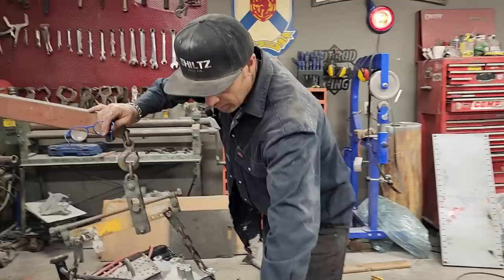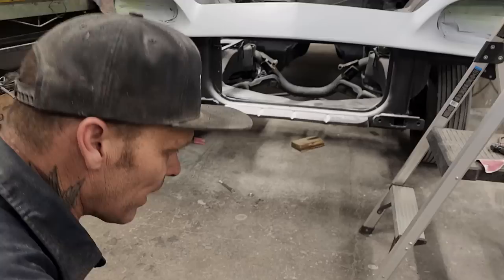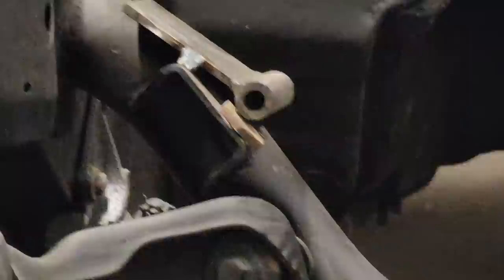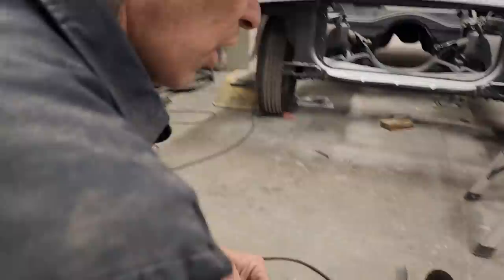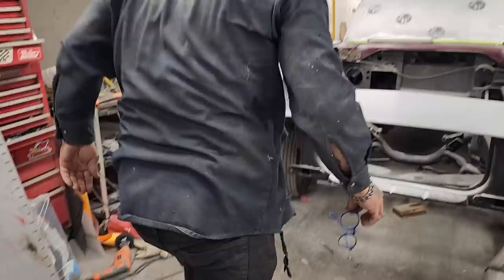But what's going on is, if Jolene wants to come down here and take a lean down and take a look with me, when I tack the motor mounts in, see them little bars there with the pipe on it? That's the motor mounts where the engine sets in. And it looks a little crooked. What has happened is I used smaller bolts to shove in the motor mounts, and it did not give me a true read. I don't like the look of what's going on. I do not like it. But when I pulled the engine out, it was level and looked really good. But now what we're going to do today is we're going to make the mounts look like something.